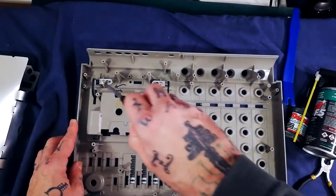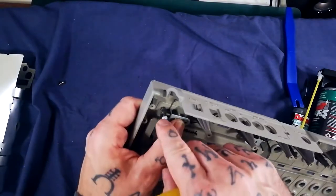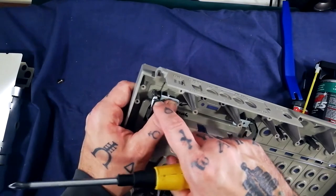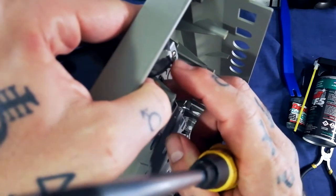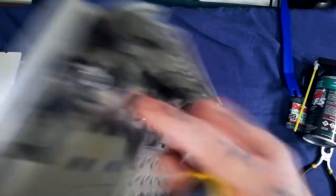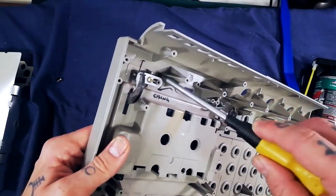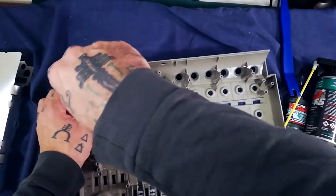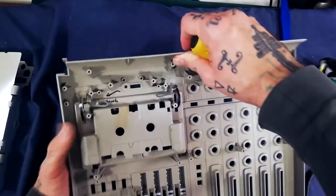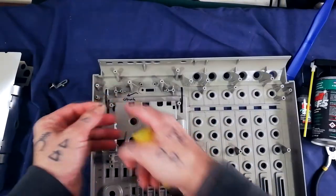The door uses metal screws through recesses into plastic mounting posts. Notice the spring: the square end wraps around this door hinge, and the straighter end has a little L shape that sits hard up against this plastic surface with the pointy part pointing upwards. If you unscrew that, those clips are identical, and the spring goes on this side.